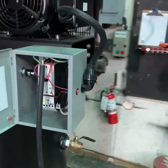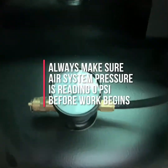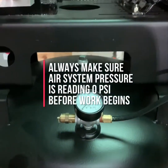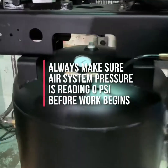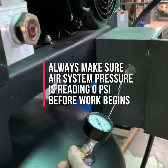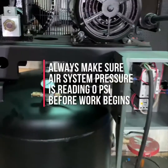Make sure that this pressure has been drained down to zero. You can check by checking your tank pressure gauge to make sure that it reads zero. You can also check by pulling the tank safety valve to make sure that there is no pressure left in the tank. The tank safety valve is typically located somewhere near the gauge. Once you've checked all these things, your compressor is now safe to work on.